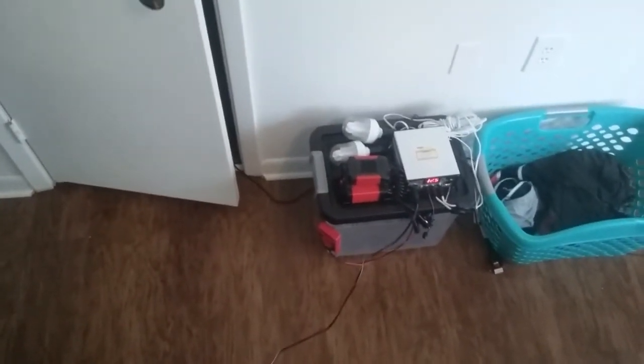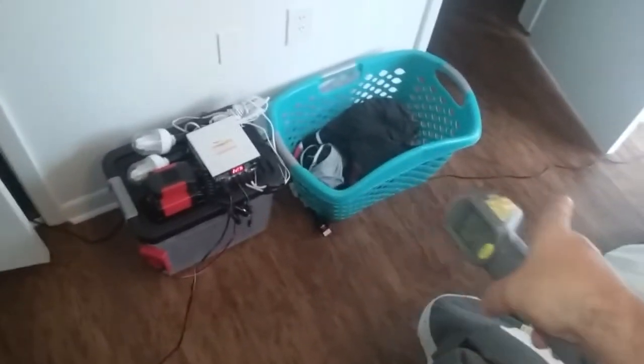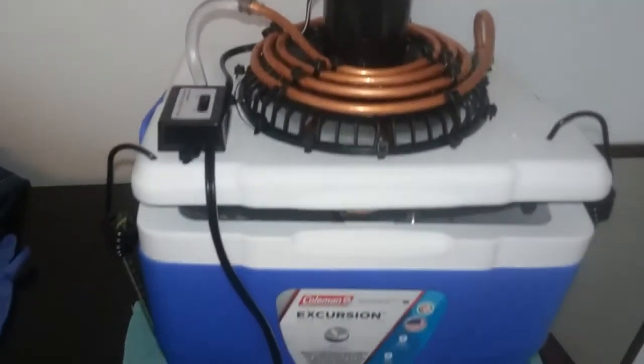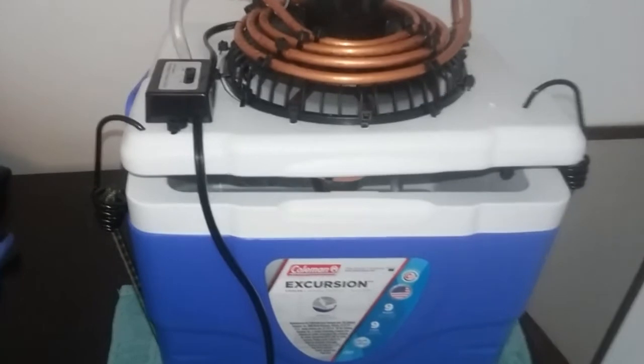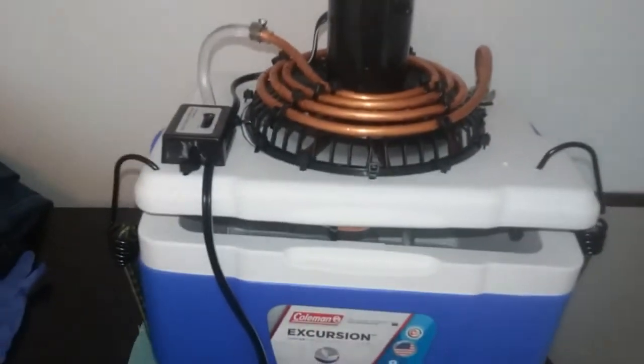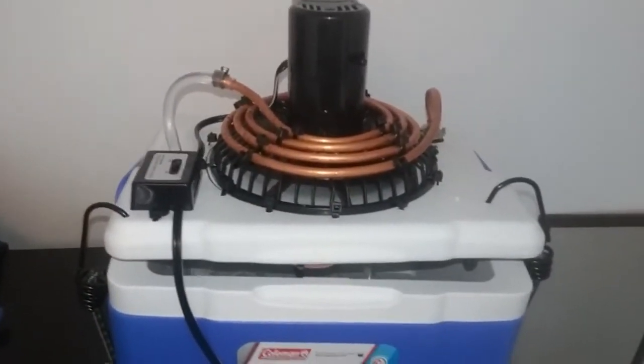It's so cost efficient and energy efficient because I'm running it from my solar panels. My solar panels come in and charge my battery bank. I only have like a 70 amp-hour battery bank, but that would run this in a 24-hour span, and then I could just take my battery charger and recharge my bank if I had to.